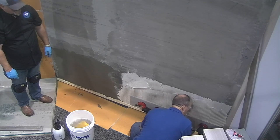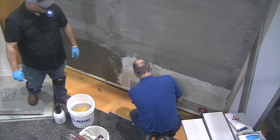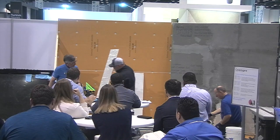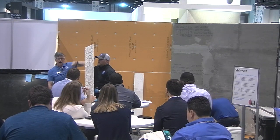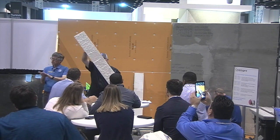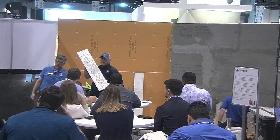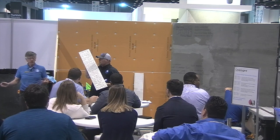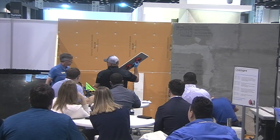It has to be consistent along the entire spread. They've got it spread with the quarter-by-three-eighths. Randy's got his suction cups applied to the tile, he's putting it in place, shifting it back and forth to collapse those ridges and putting some force on it. Pull that off, Randy — let's see what we got. We upsized the trowel — this is the only thing we changed. Still short in the middle. We're making pretty good contact in most areas but not in the center, which could mean the tile has some warpage within the ANSI standard, or the substrate isn't quite flat enough. We need to upsize the trowel one more time. He's already using the next size.